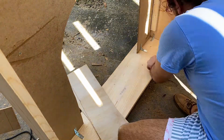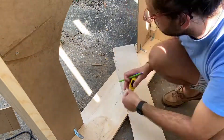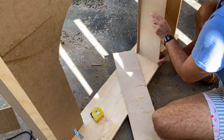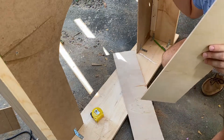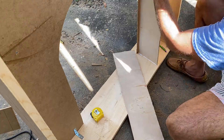To create the mantle border, I used a 2x3 that I actually found for free in the scrap wood section at Home Depot — always check that section! I used three-inch screws and wood glue to screw it in place around the opening. I also used some leftover laminate wood and extra MDF cut to size for the side pieces. These were very small pieces to cut, so I placed them at an angle using wood glue and held them in place until they were sturdy.